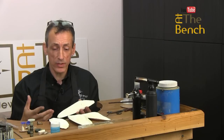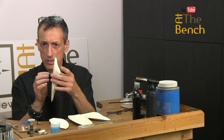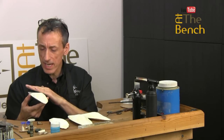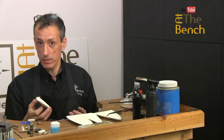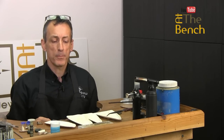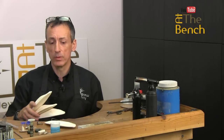Before you go any further, go onto your patio or outside against a nice flat stone wall and rub the cuttlefish. We've got the hard shell on one side. What we need to do is flatten this softer belly side until we get a nice flat area. I've done that already — I do this against my neighbour's wall when he's not looking, and he's always wondered what this white powder is on the floor. The cuttlefish, because it is a skeleton, has the most gorgeous texture — and this texture is only really obtainable by using cuttlefish.